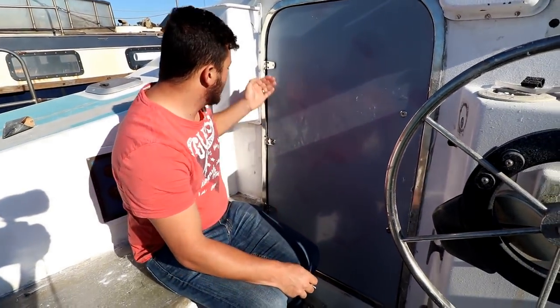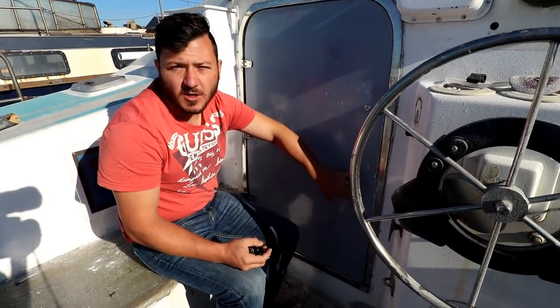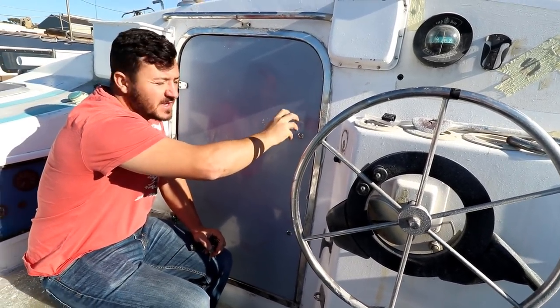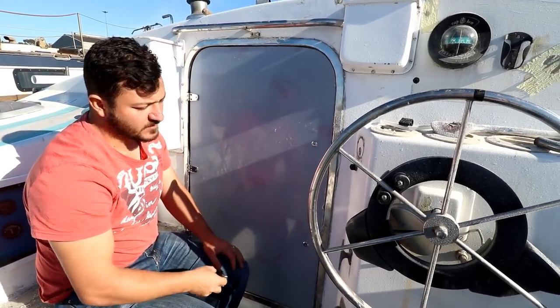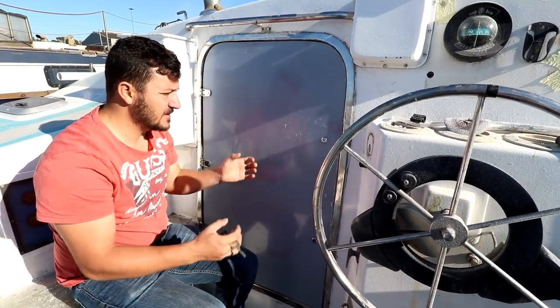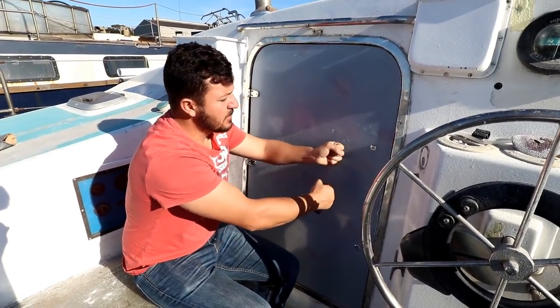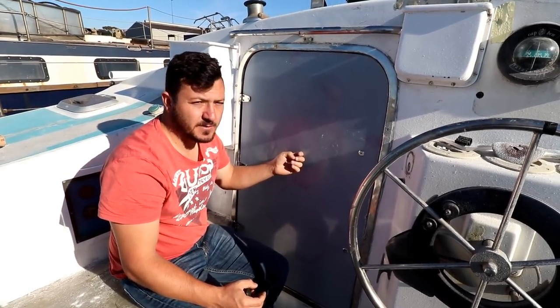We've got the polycarbonate door in — we went with a three-inch system. We still need to add screws; this is just temporary. We've got a two-lock system, only locked when you're going somewhere. I'm going to add a plastic latch system that can open and close from inside and outside. When you just want to close the door and latch it you can, and then lock it when you leave. The reason I went with a small handle on the outside is so it doesn't give anyone leverage to yank at the door. According to the manufacturers, at 12mm polycarbonate it's unbreakable — though I'm sure everything's breakable somehow.